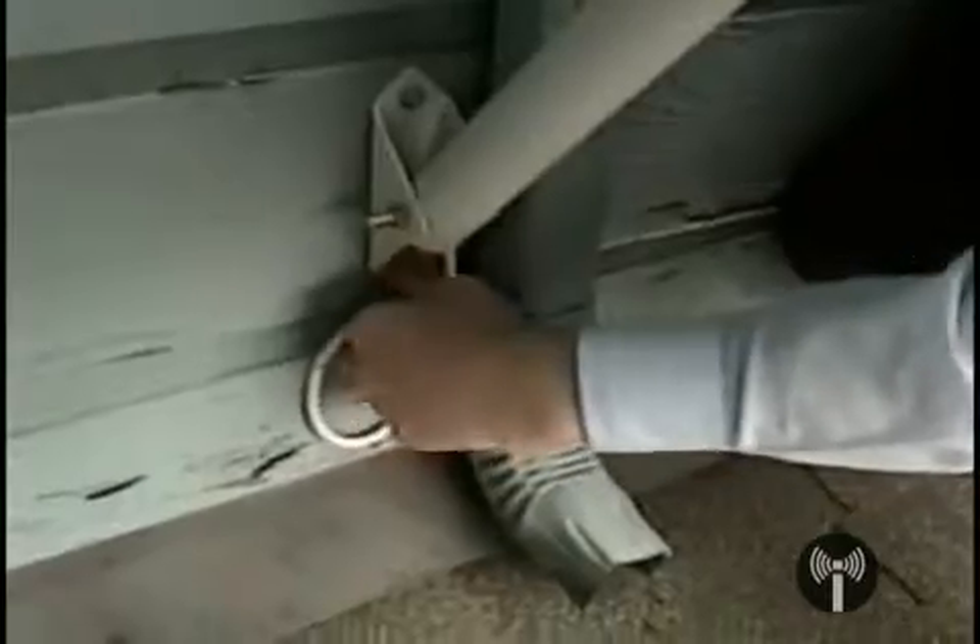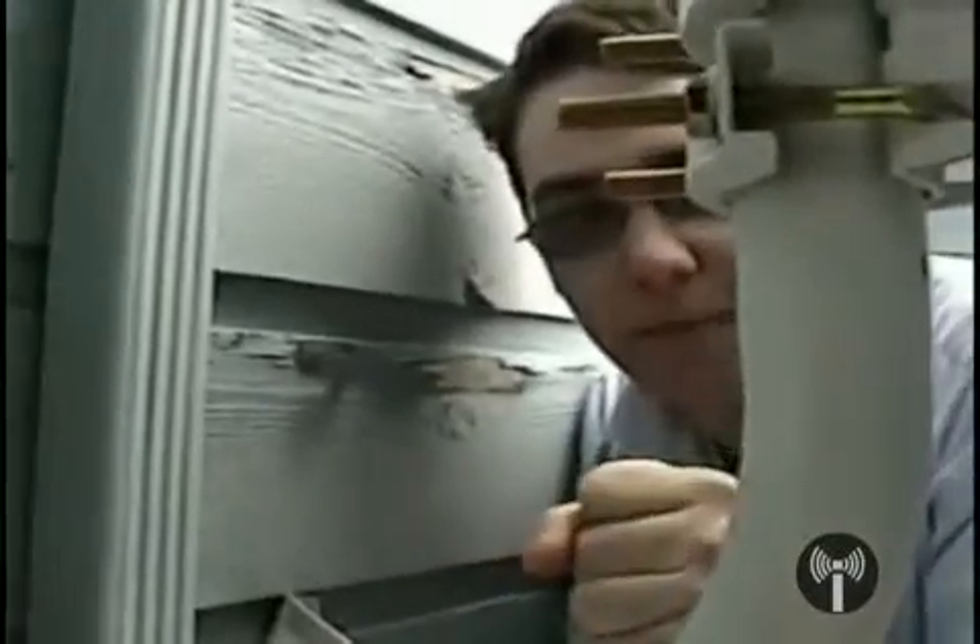As you can see here, you've got the main support arm which holds the dish, and that's got two extra supports which also bolt into the wall. Most dishes come with bolts similar to these — nice and secure. If you've got a good drill, you can fire them right into the wall of your house, and the same at the bottom. The important thing when setting up the satellite dish is that everything is plumb. Bring a level to make sure everything is nice and flat, because if it's not flat, you might mess up your aiming when you get to that point later on.